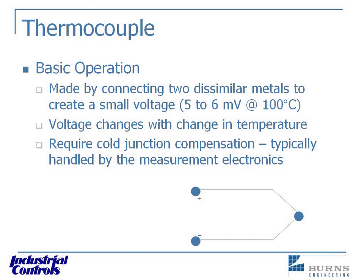As we talk about thermocouples and these two dissimilar wires, these wires break down over time. The longevity of a thermocouple really starts to deplete from the day it's fabricated. The higher the temperature it's used at, and also the type of atmosphere it's in, can affect its accuracy. Mostly it's due to contamination of those two metals, which can lead to temperature drift and some other bad things.